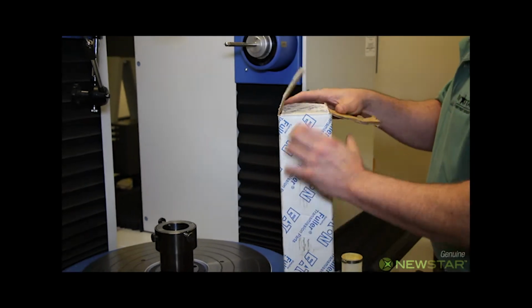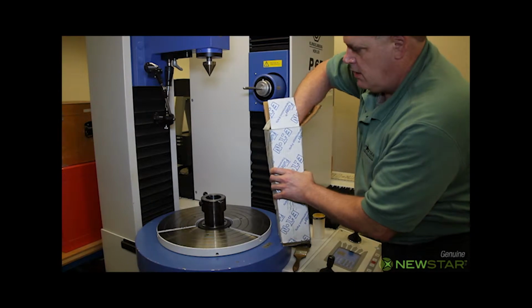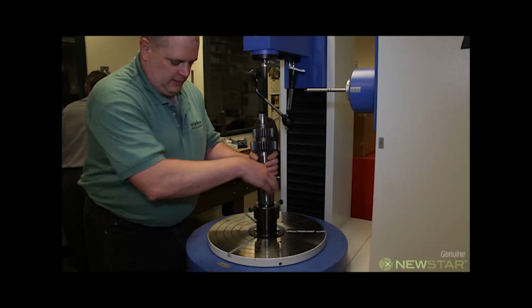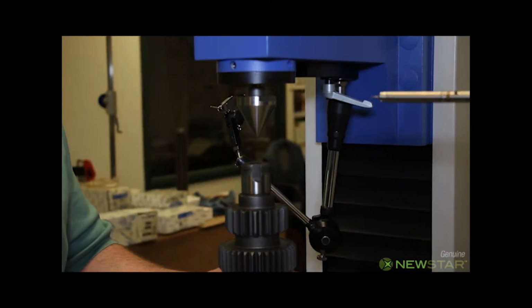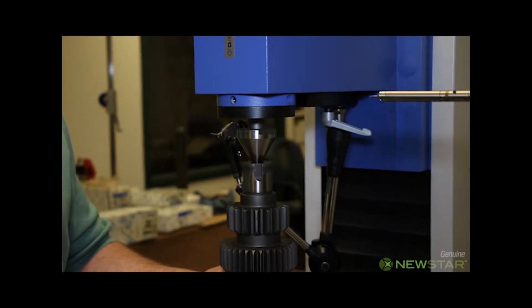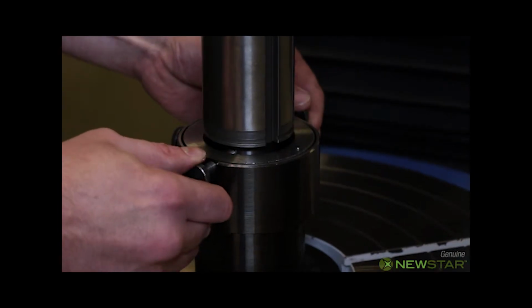Mark is our mechanical engineer. He's placing an OEM countershaft on our Hoffler gear tester. This computer-operated testing machine allows us to determine the exact tolerance class of the gear according to standards established by the American Gear Manufacturers Association. The AGMA is recognized worldwide as the main standard for gears in the United States.